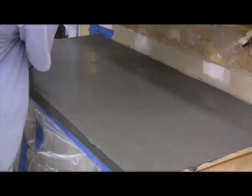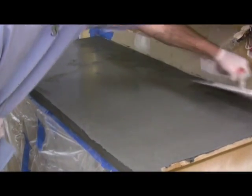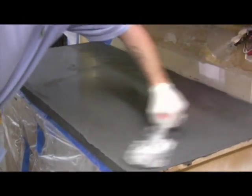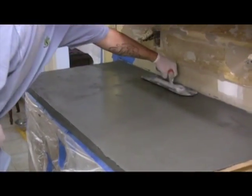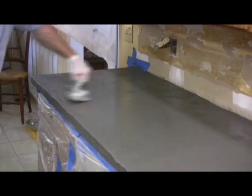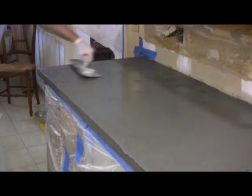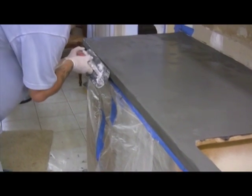Apply more pressure to the trowel than you did on the bond coat. Notice how smooth the top coat is becoming. As the top coat begins to set up, occasionally spritz with polymer, allowing your trowel to move over the surface more easily. Don't use water. The polymer spritzing will help achieve a smoother finish. Keep your trowel clean with a damp rag. Work the edges repeatedly and be patient. You have time.